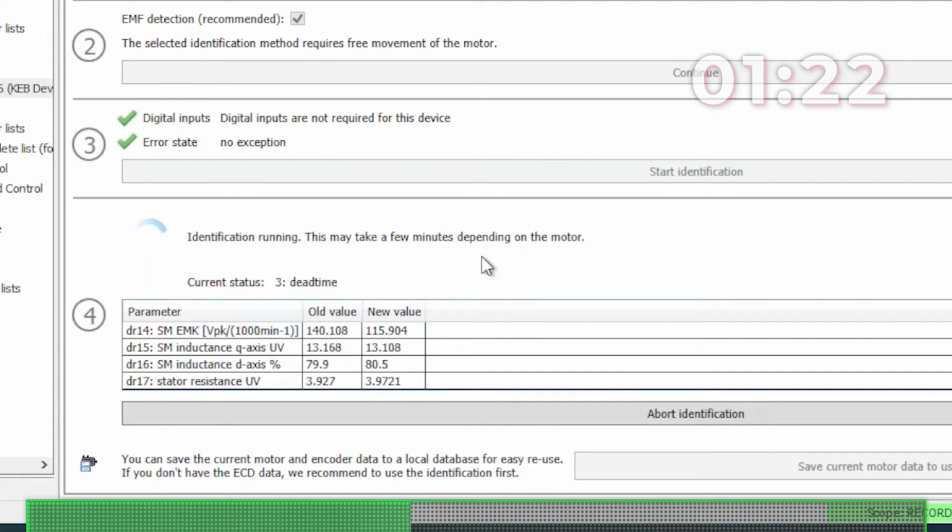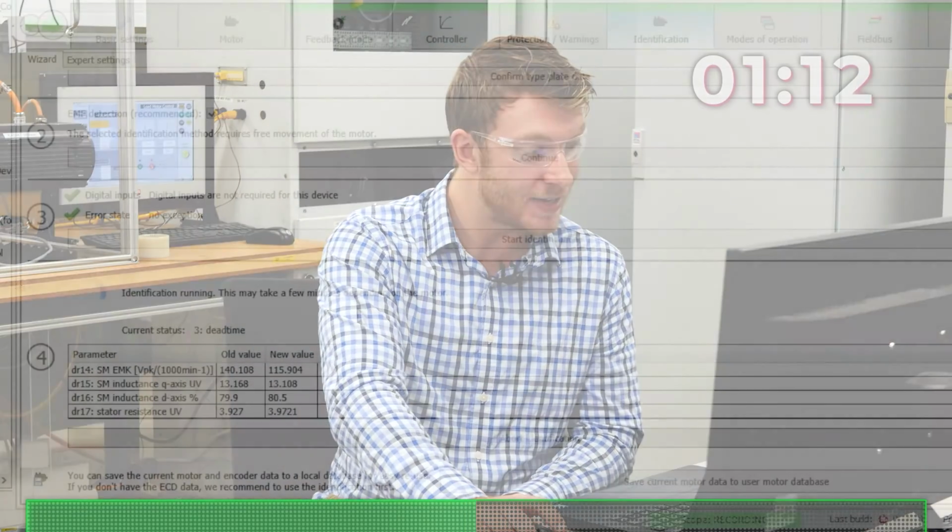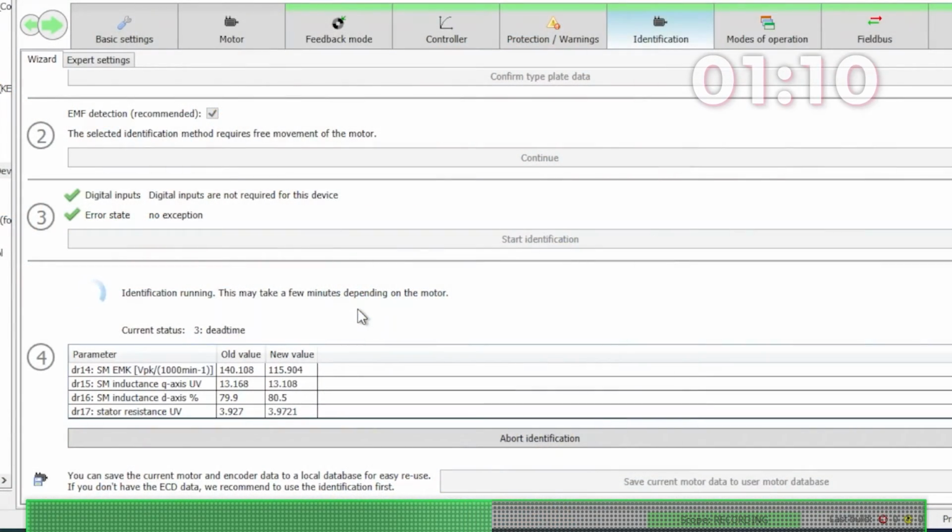So then it's doing this so it can actually run sensorless closed loop as we discussed. That's a version of motor control for the T6 that actually doesn't require any actual encoder feedback. Instead it's using values like the motor voltage and the current, and then actually combining those with a sophisticated motor model and running calculations to actually close that loop instead. So it's running in very accurate closed loop operation with no additional hardware.